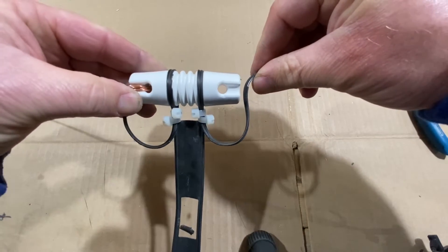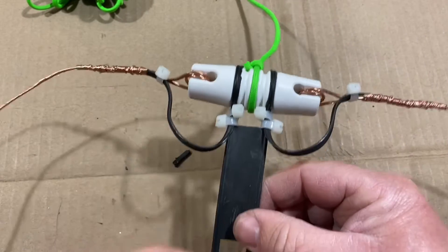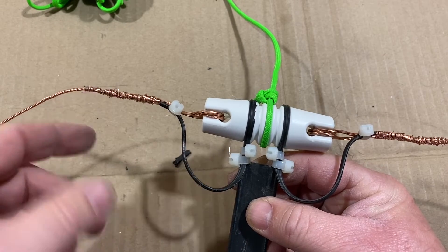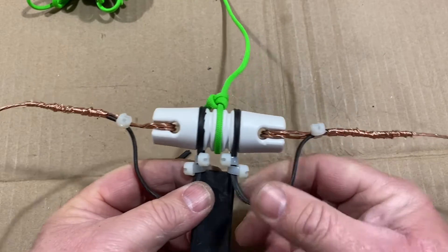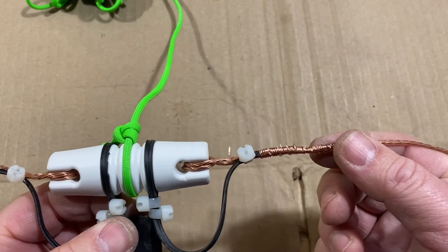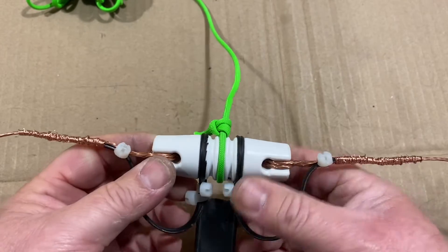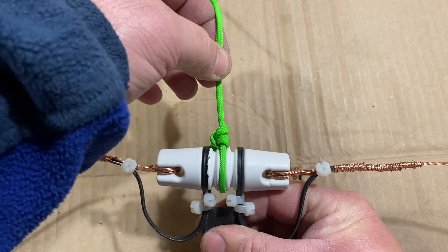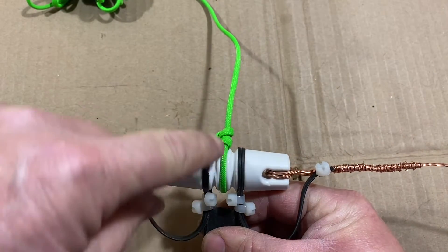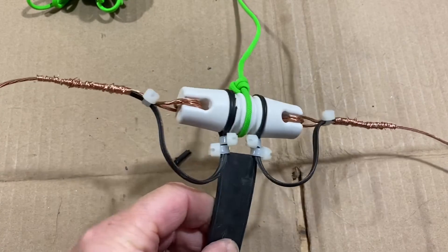Come up here and go with your wire and wrap. Here's the finished product — we've got our splice connection to this leg and did the duplication over here on the same side, did a little better job on my wrap on this side. You just wrap, wrap, wrap. At the center of the insulator, when you're ready to pull it up into a tree or on a pole, tie your rope right down the center of the insulator and get her in the air. That's about all there is to it.